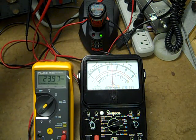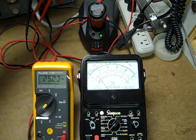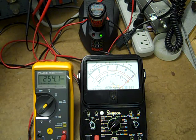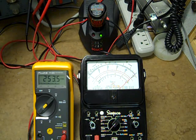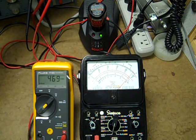Back off to about 25 volts — once again the accuracy is very adequate. 250 volt range: 250. Then 253 volts. 500 volt range, which is about the maximum that this power supply will do: 505. That's about a 1% error there.